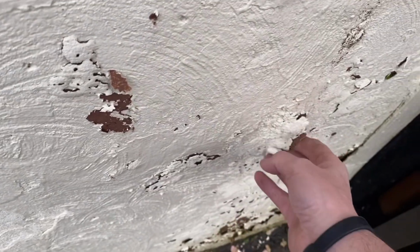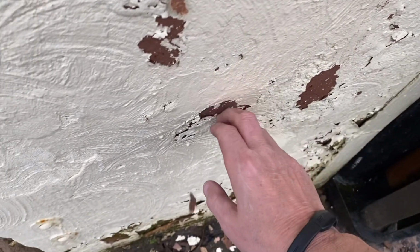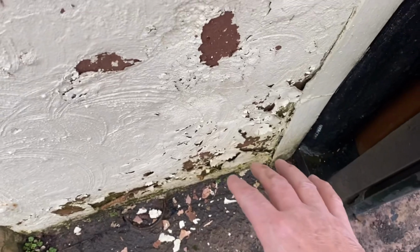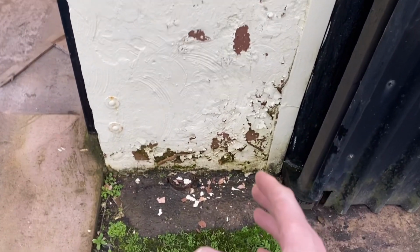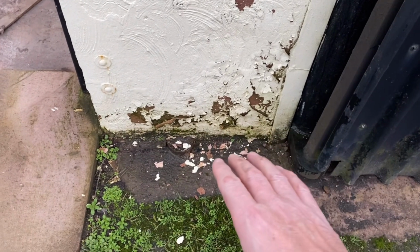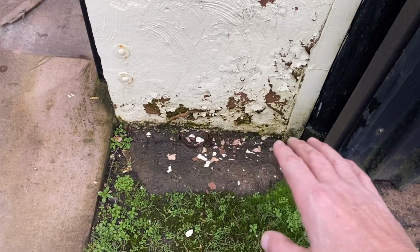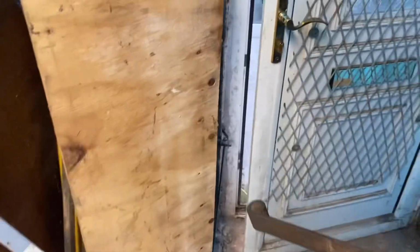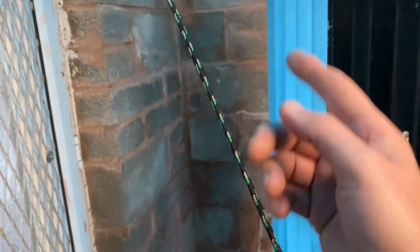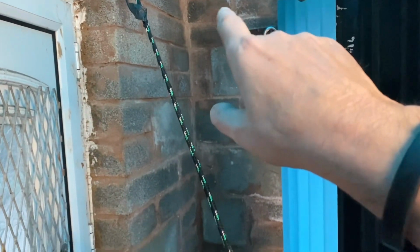It's better than it has been in the past, but it's not good. There's no salt in there, so last time we put that undercoat stuff, so we have got a problem here. I don't know whether it be rising damp. Did we put a damp course, or is it bridging? We probably put a damp course under the building, and this may have bridged the damp by putting that block there. So some of that could be rising damp. It's too high. Rising damp doesn't go that far.